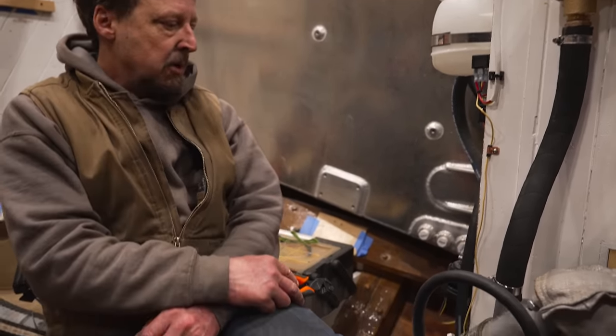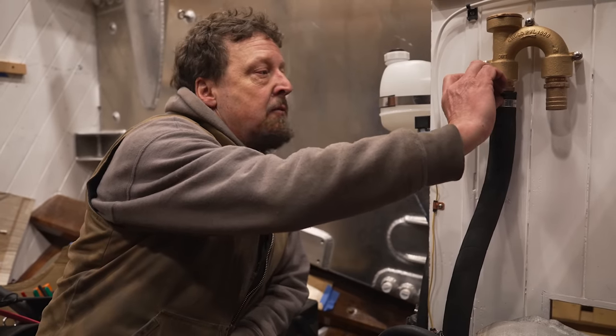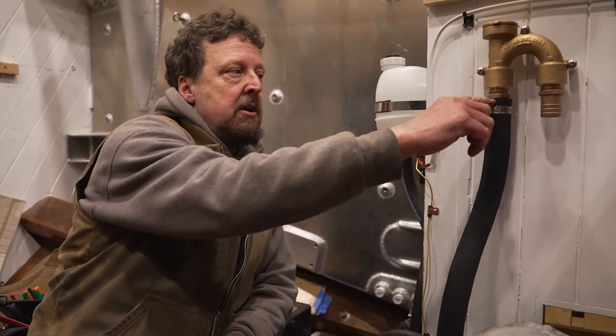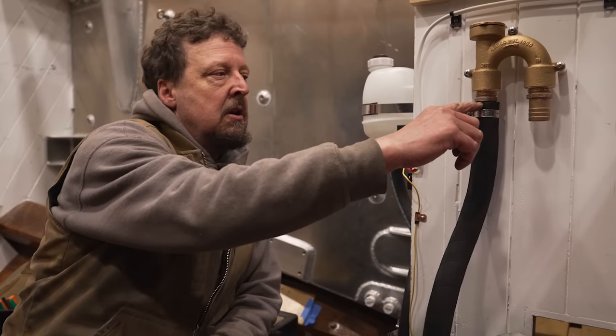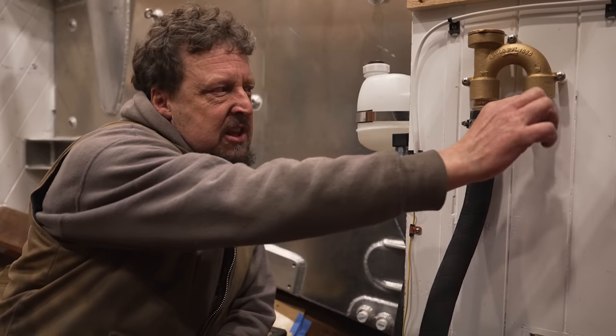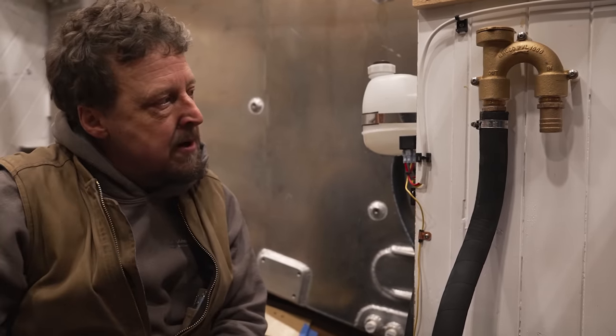And you'll see we have double hose clamps here. And on fuel fills and fuel vents. You would like to have one hose clamp's width of space. You don't want your hose clamp right on the bitter end of your hose. And you don't want it overhanging the barb. So these barbs, you could almost get legitimately two hose clamps on them.